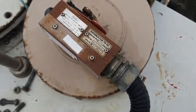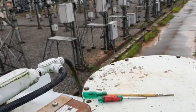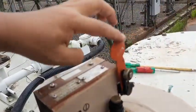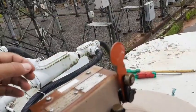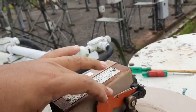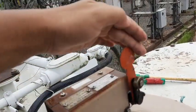The pressure inside will push this lever, and it will go up like that. This flag is a mechanical indicator that the PRV has operated. To reset it, you have to manually put this flag down. If it operates again, the flag will go up again. This is the reset position.